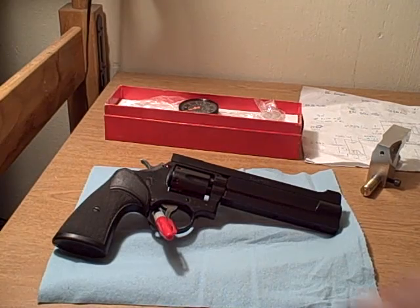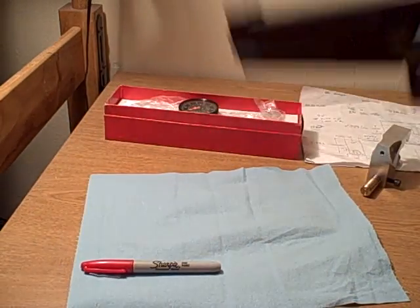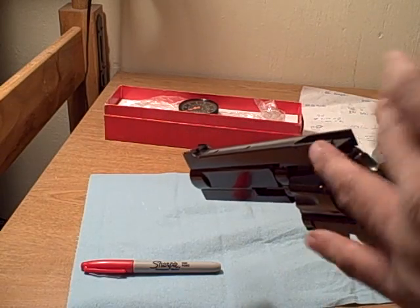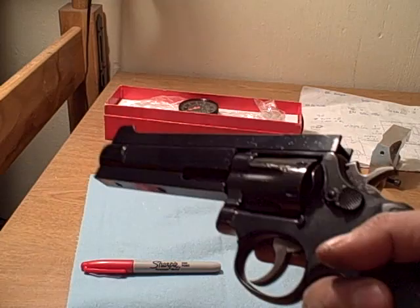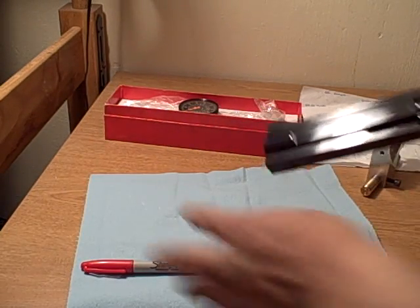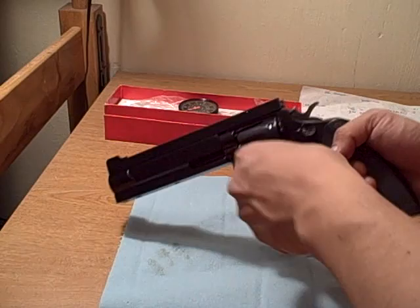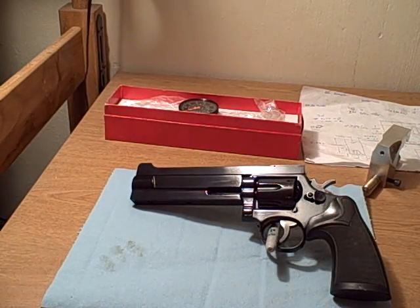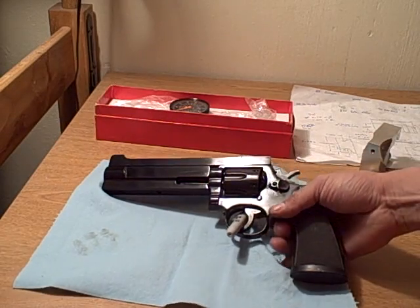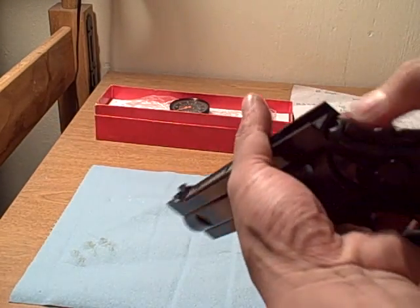As you've already seen, the PPC revolver — I guess I'll start with that. I just got it back from bluing. I didn't like the back sight, so I guess I'm calling this completed for now. I took it out for bluing and didn't put it back because I think it looks better this way. I understand the reasoning — you want a longer sight radius because this is a competition revolver. However, I like it better like this, and I don't know if that extra inch really makes that much of a difference. Right now it's soaking in oil, so some of these streaks are just gun oil on it. At some point I'm going to re-blue it, because right now it's about factory blue — like what you would get from a new Smith & Wesson revolver — but it's not custom blue yet. Overall it came out pretty nice and I'm very happy with it.